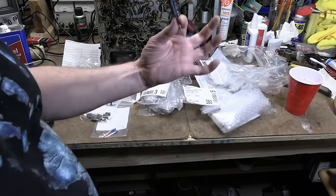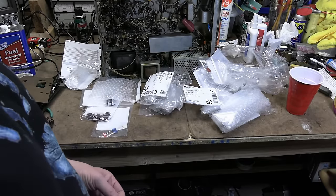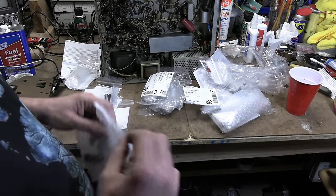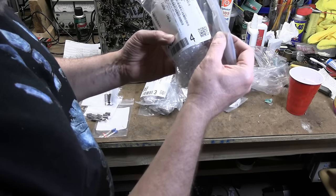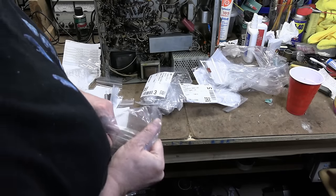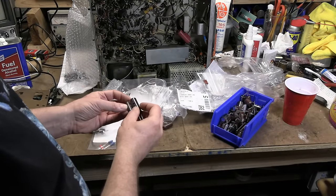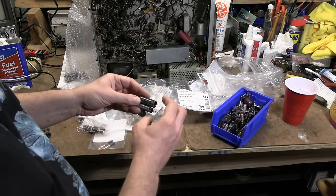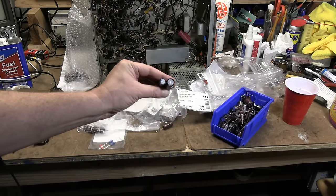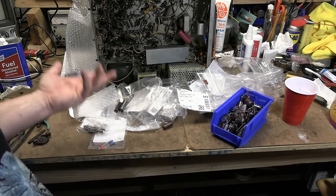It's actually just one cap in there. I got a whole bunch of 47s, so let's do a little comparison. These are 47 450s — let's see how a 47 450 compares to a 47 500. These are both 47 microfarad Nichicon with very similar specs: 500-volt versus 450-volt. Considerably larger diameter just to get 50 more volts. Anyways, that's what the specs called for in a few instances and I thought they were warranted, so that's what I got.